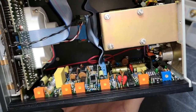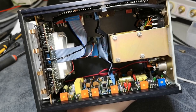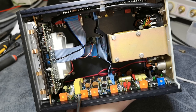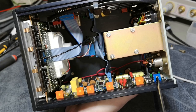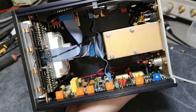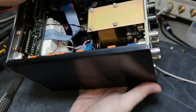You can easily access all the trimmers from the top — you don't see this detail in a lot of instruments. Sometimes they're mounted all over the place, rotated up and down and left and right, or they just drill holes in the back, front, and bottom so you can access the trimmers. But here — they used their brains from day one and figured out to put all trimmers accessible for easy service.